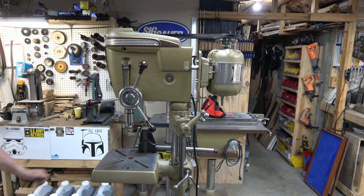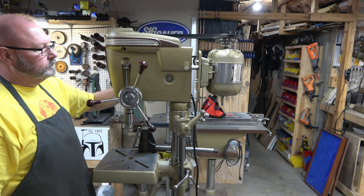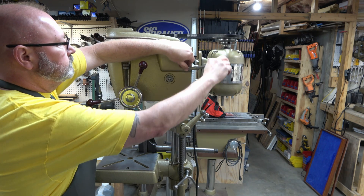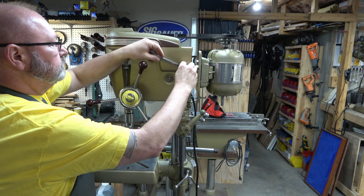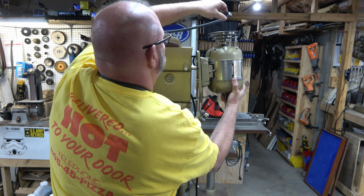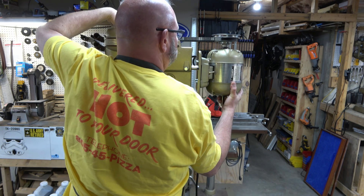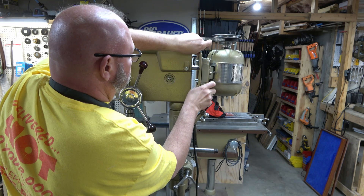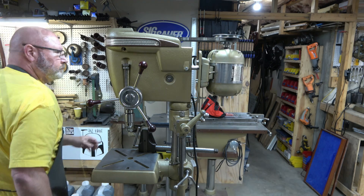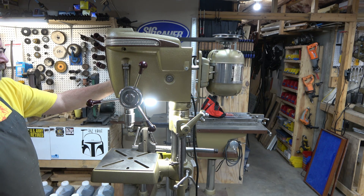For all these speed available options you had to go through a number of steps to be able to change the speed of the drill press. You had to turn the drill press off, loosen the motor mount screws, push in or tilt the motor, move the belt to the correct sheaves to achieve that desired speed, re-tension the belt, and then tighten down the motor mount screws and turn the drill press back on. Although the 150 series with its tilting motor mount made this a little easier, it was still a process to change speeds.